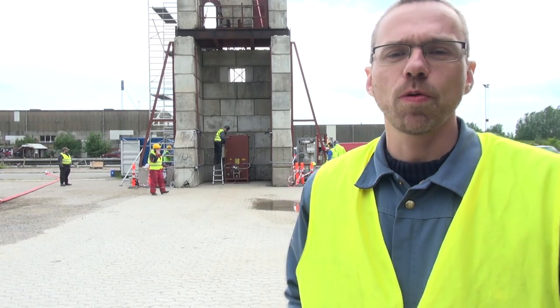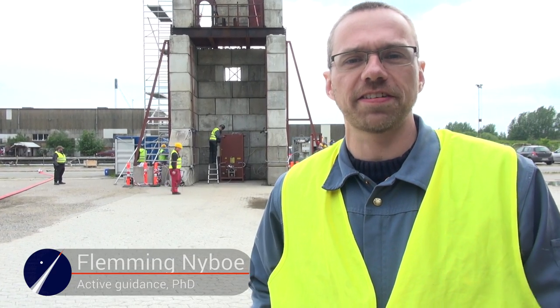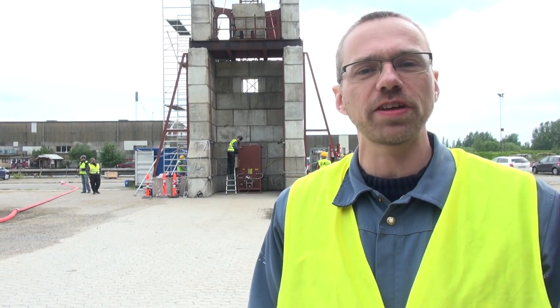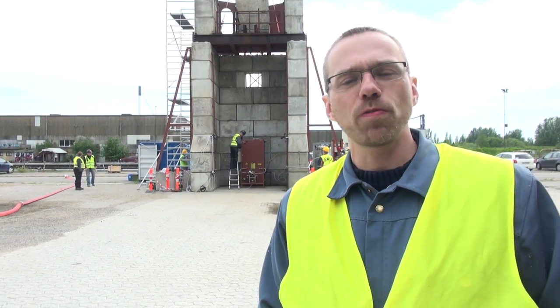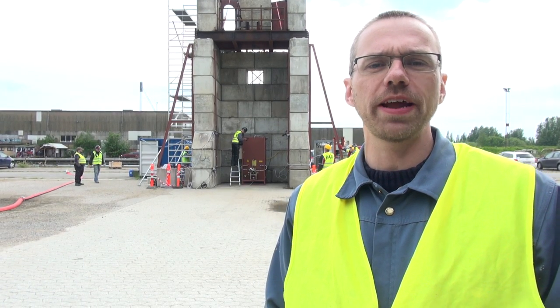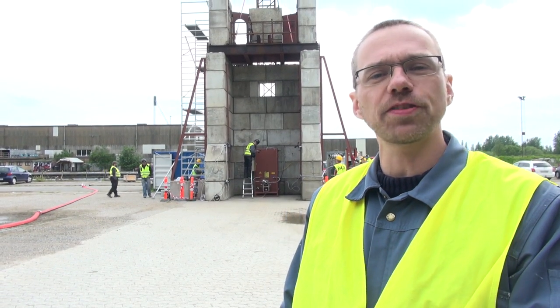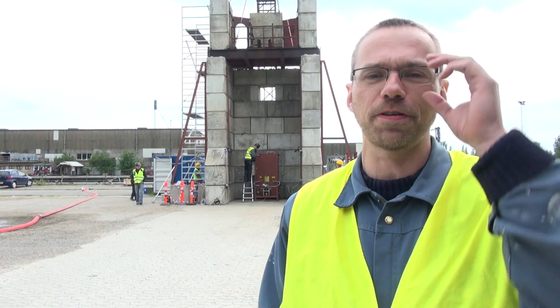So, one other thing we've tested today is jet vanes. In order to fly with jet vanes, the big challenge is to find any material that can actually handle the jet exhaust without just disappearing. And we've tried one vane in copper and one vane in graphite. And we've flown copper before on the Sapphire rocket. But this engine is very different in a number of ways.